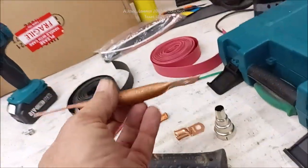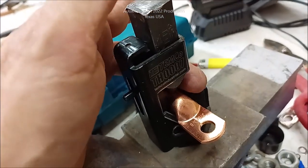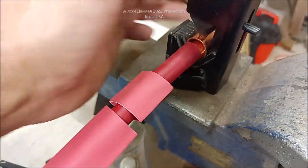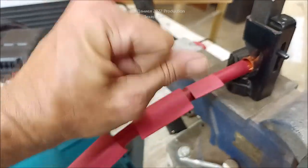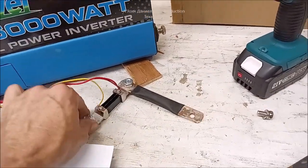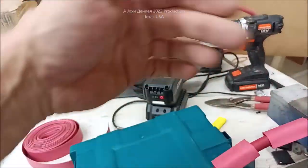Now this is a Temco terminal — very good quality. A lot of these don't have the pressed-together design and they get loose, but the Temcos are very good. Push it in and it'll stop right there on the heel of your terminal — it doesn't push further. The way these work is they use compression displacement contact — everything smashes into itself and fuses. This big one here has to have much heavier cables — that's why it's increased in size — to hook up this inverter to the battery. Stay tuned, another video coming. Be sure you subscribe, and if you want to support the channel, there's a 'buy me a coffee' link — John Daniel — at the bottom.